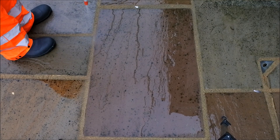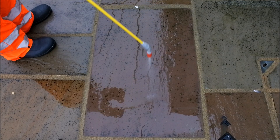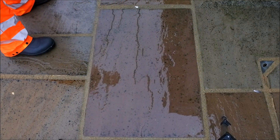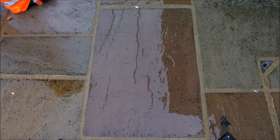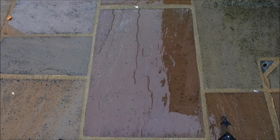The customers are disheartened with their surfaces. They've had them jet washed over the years trying to keep the Indian stone clean, and gradually over the years it's deteriorated. They're quite disheartened, having some regret for laying the Indian stone because it's deteriorated that much. The black spot is quite prolific on the surface — they've just had it jet washed and it wouldn't come clean, and over the years it's damaged the pointing and they've had to replace it with resin pointing, as you can see here now.